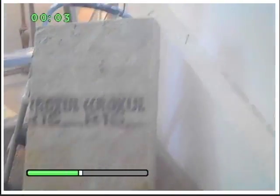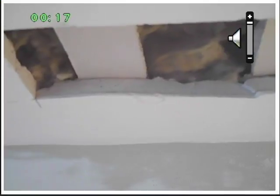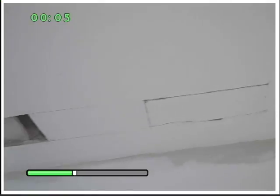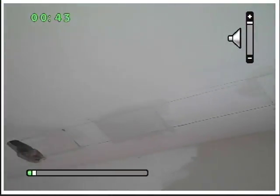Next step is putting the Roxul up there in the holes. So now you get it all insulated. All you gotta do is save the pieces that you cut out and put them right back in, like so. So there's one done. See, that's pretty good. Wait till those braces all glue up and dry and put the rest of the pieces back on. So there you go. Put them back in place, except for one I have to go through the trash and find. Okay, so you got the braces in there.